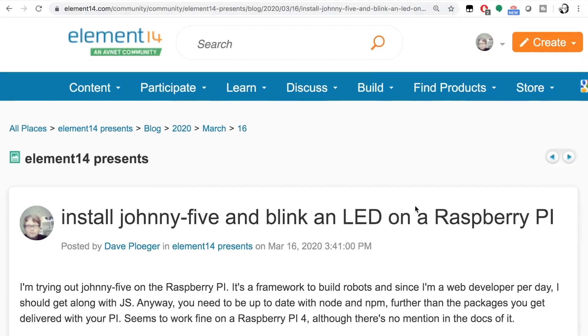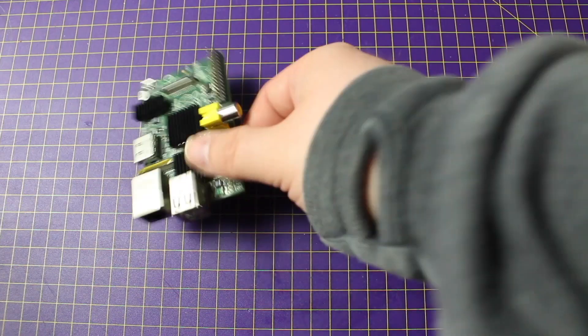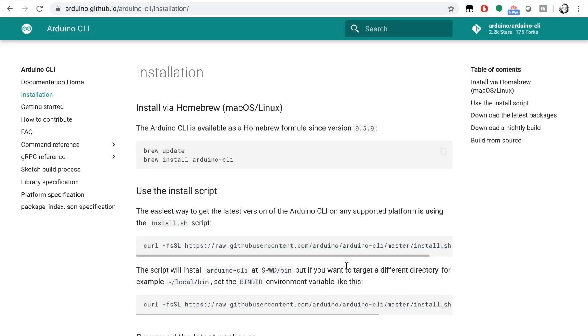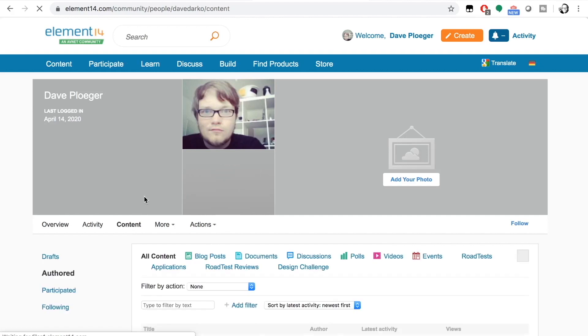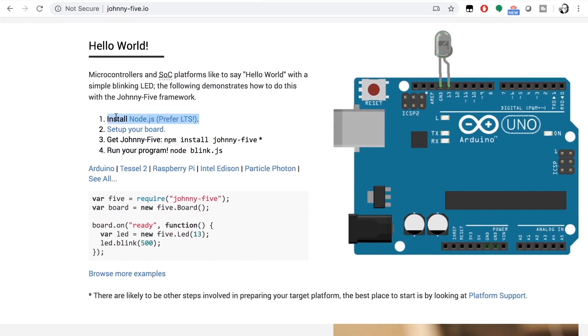While waiting for parts I had already plugged everything together with power supplies. To make the Johnny-Five framework work, you have to install or upgrade Node to a certain version, otherwise it just won't work. Johnny-Five works like this: the Raspberry Pi communicates over a serial port to an Arduino that does all the hard work. You have to install the Firmata Standard Plus software onto your Arduino first. I tried using the Arduino CLI but ran into a problem — you have to remove a module on the Raspberry Pi that keeps pinging the connected Arduino, preventing you from pushing updates. There are two blog posts on the Element 14 community if you run into the same problems. From there you can work through examples and set up pins as inputs with an event-based triggering system.